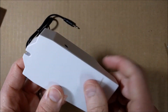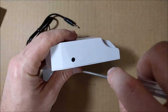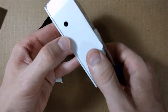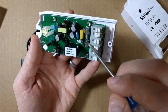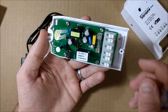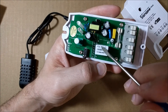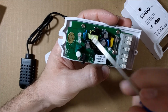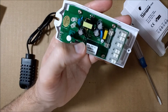Now I want to take this apart to see what's inside. There are no screws holding this together, so I'm just going to pry it open with a little screwdriver. This is what it looks like inside. You have all your terminals here. You have a fuse in here — so if you buy one of these, hook it up to a big motor, and it stops working, it's probably because you blew the fuse. This is there to protect it from overloading, because this device only handles 10 amps. The relay is really small and it can't handle too much. We have a little plug for the sensor, a relay, a fuse, a transformer, two LEDs — one for the Wi-Fi and one to tell you if it's on or off — and some bus lines. This looks like it's used to flash the ESP, which is on the other side.